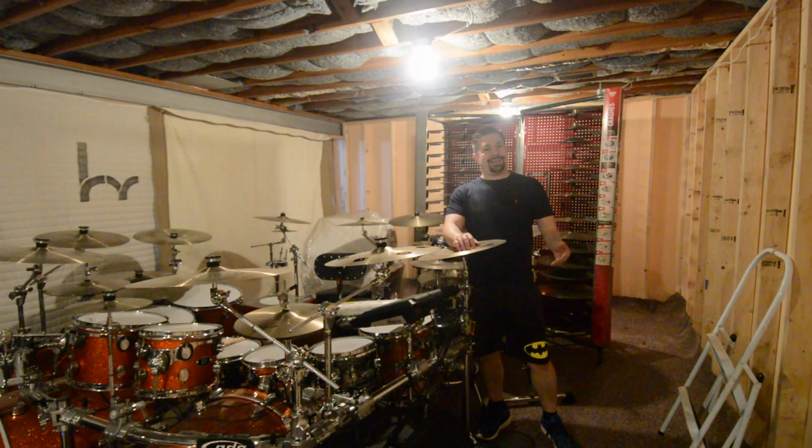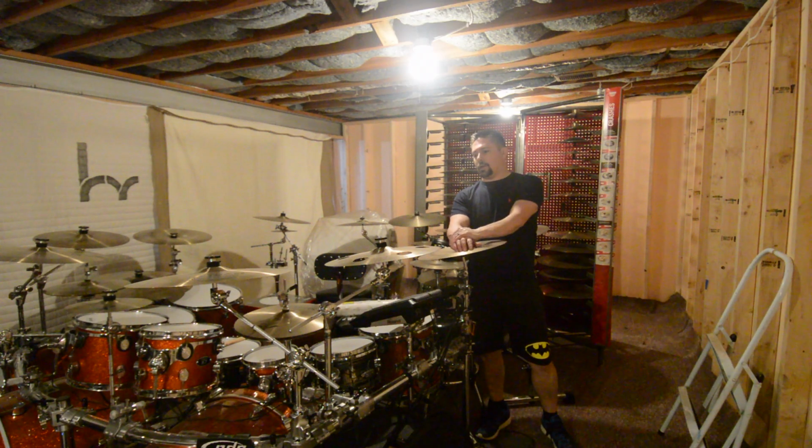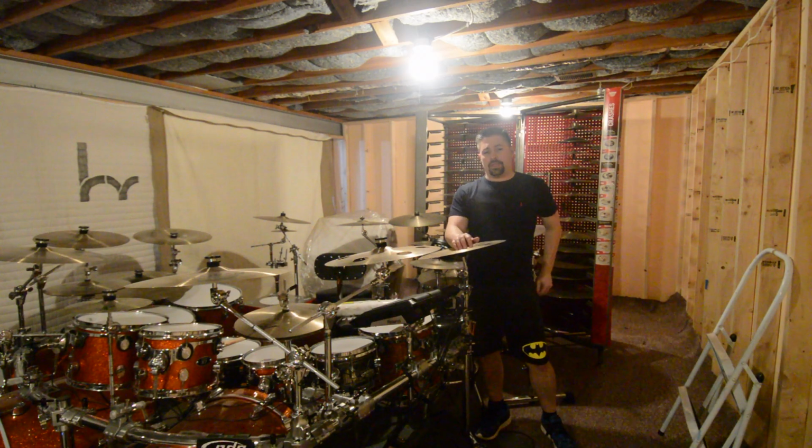So again, I apologize that I don't have much video on this, showing how we actually did it. With the limited space, I couldn't find anywhere to set all of my drum sets and all my gear, so we couldn't build the walls and place them up. We had to literally build the walls on site. We're not using anything special. We got 2.5-inch anchors going into the concrete. We're running 3-inch construction screws into all the bright lumber, and 3-inch coated construction screws into all the treated lumber on the bottom base plates.